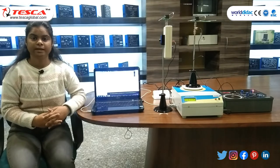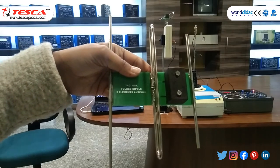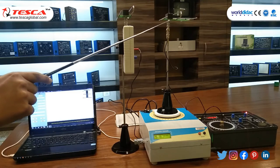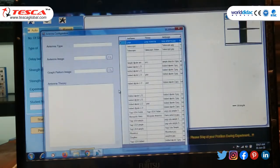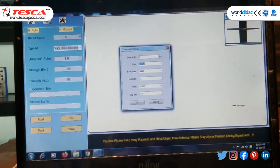For the next experiment we will use the Yagi-UDA three-element folded dipole antenna. This is the Yagi-UDA three-element folded dipole antenna. Similarly, we place this antenna on the antenna trainer and adjust the level of the RF detector to show the three-quarters reading of the main unit display, which is 100µA. Click on the antenna type, then save the Yagi-UDA three-element folded dipole antenna. Save, then check the COM port.